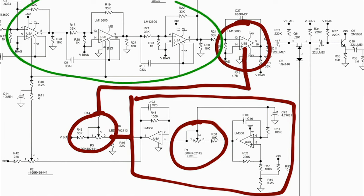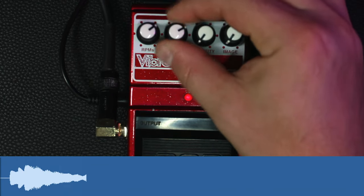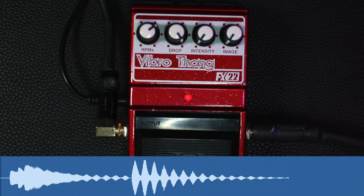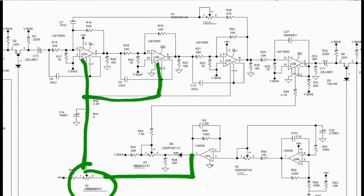So even though the whole rest of this looks like a phaser — spoiler alert — we're going to use that last stage there to get a tremolo effect, which is a modulation of amplitude, unless you're Leo Fender. And we can hear and see that modulation right here. The other leg of that LFO signal travels through the intensity knob and into the amp bias input of the first three stages. What I think is happening is that lowering these brings them out of the equation, so we're really only hearing the phase-based vibrato of that last stage.